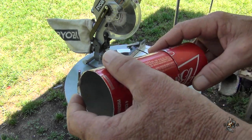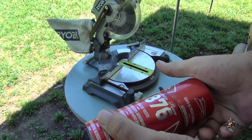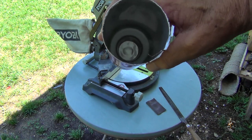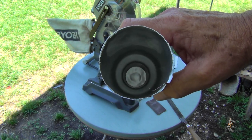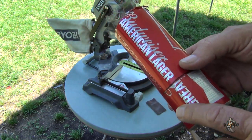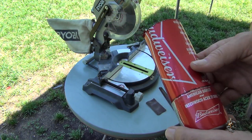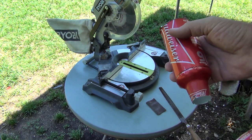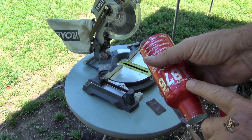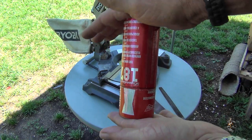I've test-fitted it together so I know it kind of fits and it's flat in there. Down in the very bottom it should be flat against that bottom, which doesn't matter a whole lot — it'll just give more ways for fuel to get up into the chamber and start boiling up, then it'll come out the jets when I cut the jets in. So now I'm gonna put some high-temp RTV silicone sealant on there, then slide the two of them together and make sure they're force-fit real good.